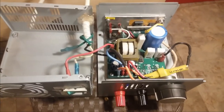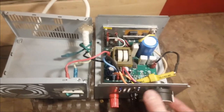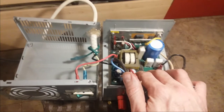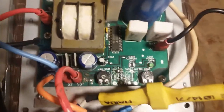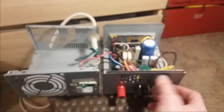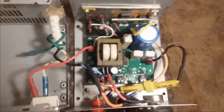This treadmill was a DC motor treadmill, and it came with this variable speed potentiometer. It varies the DC voltage out of the power supply. It has an adjustable potentiometer inside labeled 'maximum speed.' I've got that set to the maximum, and when the speed control is set all the way to the highest, that gets the output all the way up to 160 volts DC, which is pretty high for a bench power supply — great for powering whatever I need.